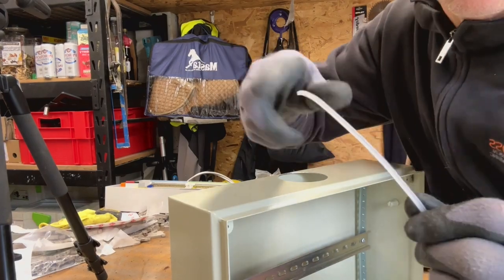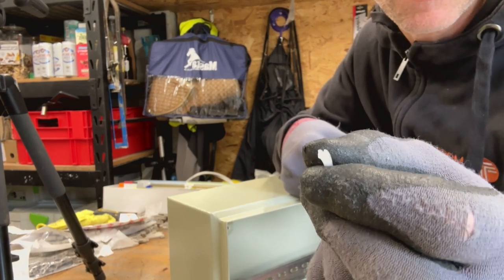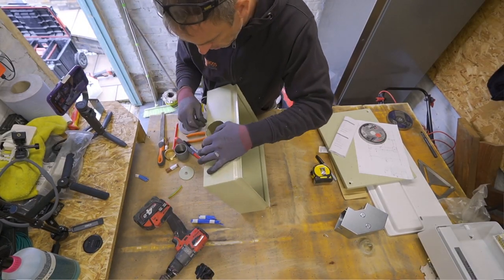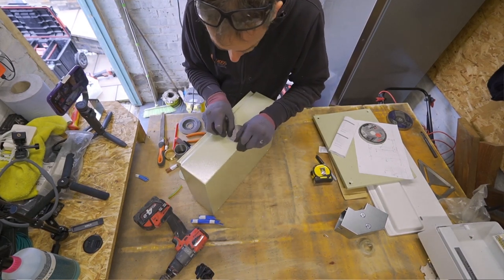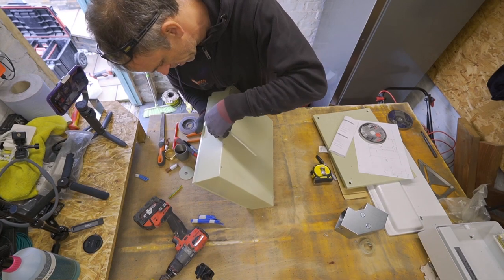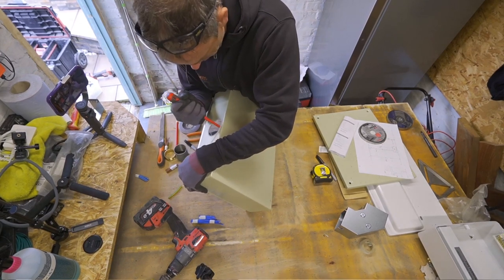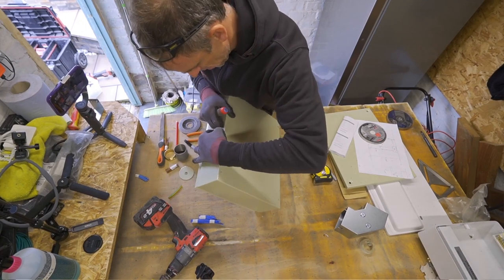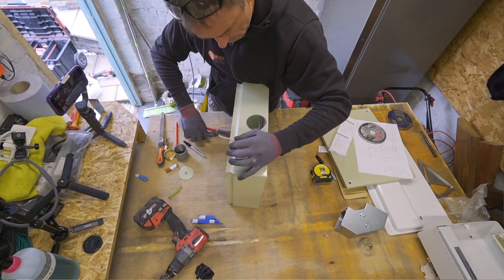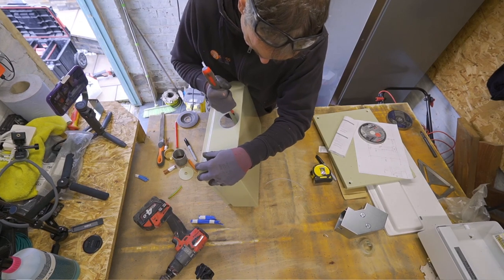So this is grommet strip. You've probably seen it before. It's like a little plastic. Well, it's grommet on a roll basically, and you can tuck it into the hole. I don't know if you can see it too well, but we'll get the joint at the back, and that goes in like that. You want to push it on really tight. I'm going to force it on because you want it to stay in there really tightly. I'm going to cut that. That's it, that's all.